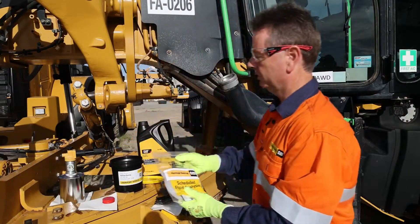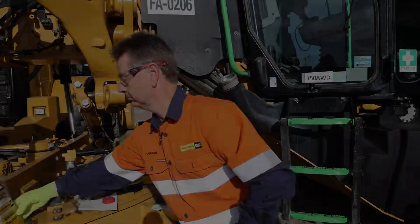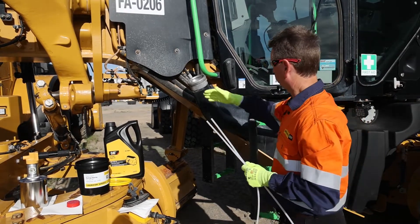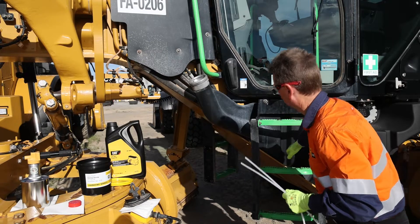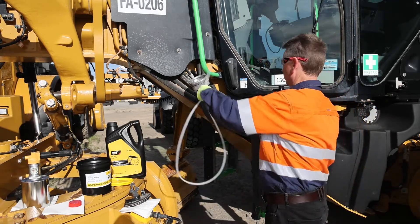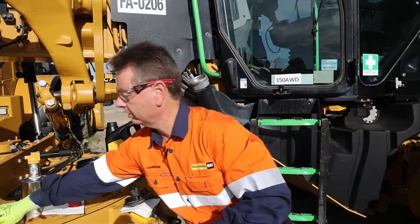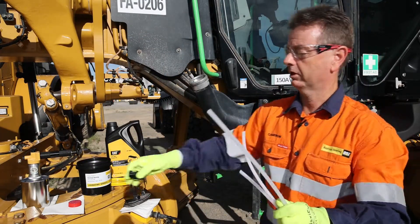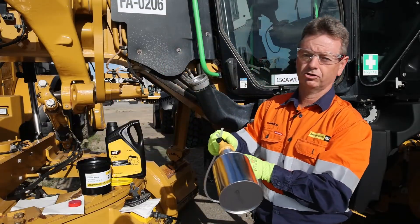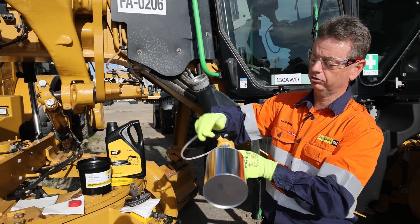We need to use clean tubing in our sample gun — this is always supplied in little cap bags from Hastings Deering. Importantly, when taking the sample we have to make sure the tubing is not too long and not too short. We look at the vessel we're about to sample — we know this one's quite full, around here — so the piece of tubing we're going to need is roughly about that long. We take our piece of tubing, take our cutter, and cut our piece of tubing ready for sampling. Now we're just going to place the tubing inside the sample pump and tighten it off to make sure it's all sealed and ready to go.